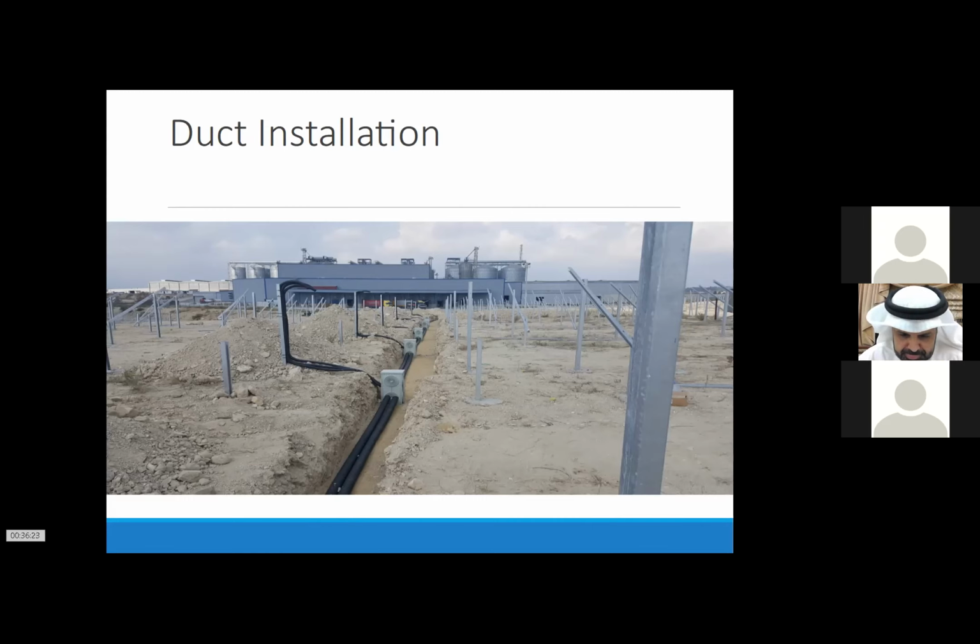I just want to ask what would happen because some of the inverters that I buy, they insist on installing a new ground rod. They said that I need to bury a new ground rod, at least 2 feet or 3 feet. And I told my technician, do not put any ground rod, just connect the ground to the main ground rod of the premises or the system ground to avoid the step voltage. Yes. If I follow the manufacturer's guideline to install a ground rod.